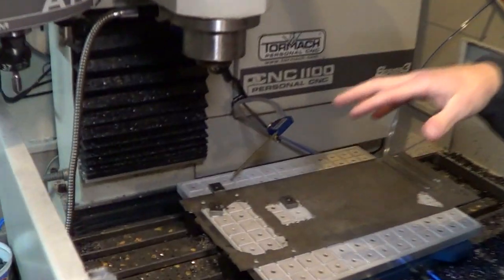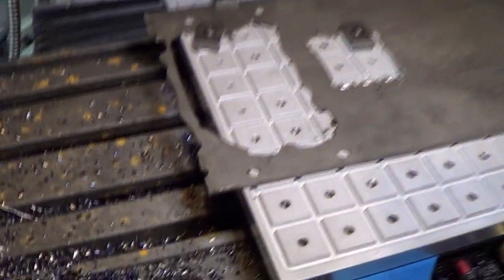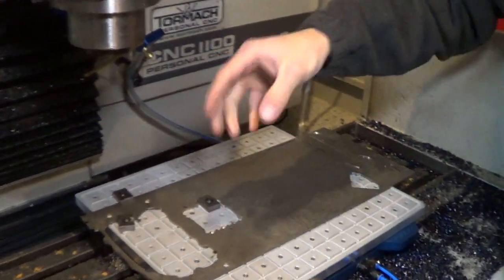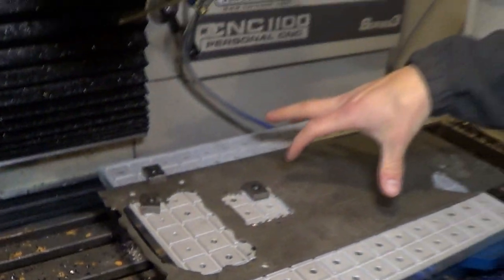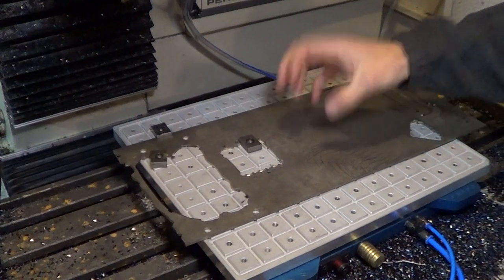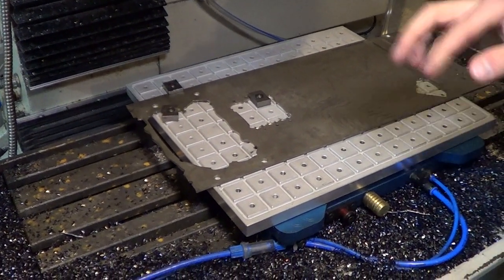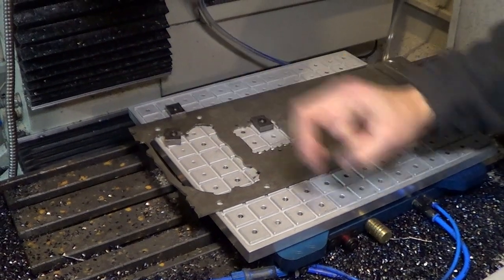Here on our mighty vacuum pallet we've got a grid plate, and this one is tapped on every single hole for M6. A lot of you guys commented last time thinking all those holes go through — they do not. Only the center hole goes through; these are all blind holes meant purely for screwing down stuff, not for suction. All the suction comes out of the center hole. We have a piece of junky titanium clamped in at three places and the center hole in the vacuum fixture is plugged so it does suck down.